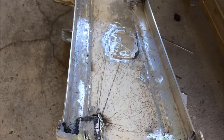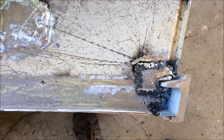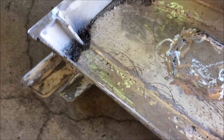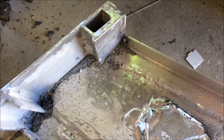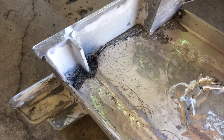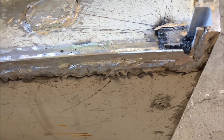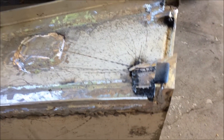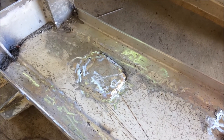A little bit of progress on the first half of the motor mount. I'll seal this hole. Added angles top and bottom. Trying to plug weld some of these nasty little corners. I don't have a good bit for my pencil grinder but I will get one. I'll grind that aluminum back to clean metal and then I can put a semi-decent weld over the top — not much of a welder. I now have a good overlap where I'm going to add the plates to make this thing longer, and I'll have three separate sealed compartments — that's my goal.